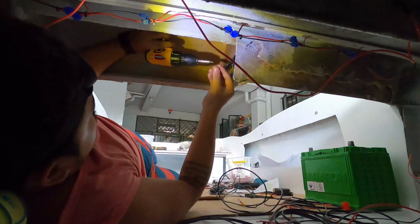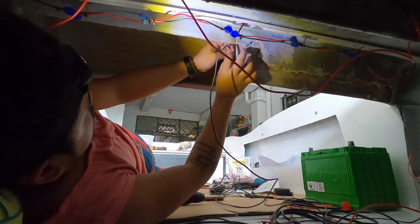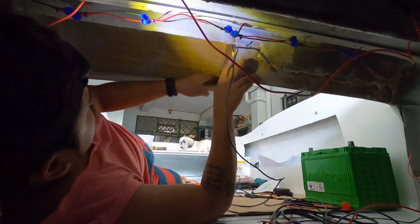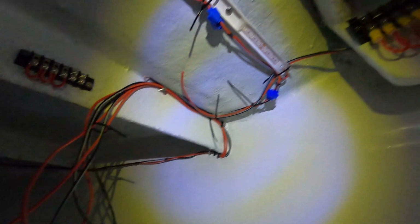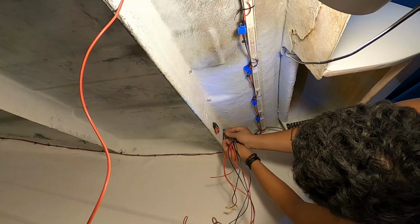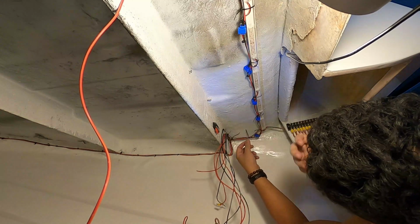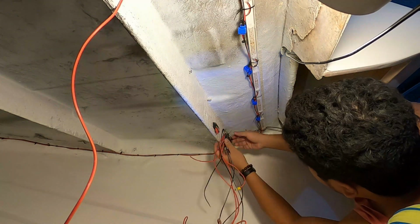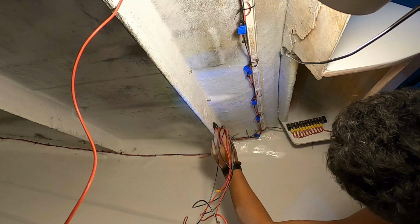In organizing wires, I used screws, lots of cable ties, and a huge amount of patience and planning. It is much better to organize all wires and make sure to fix it properly without having any chance of short circuits. A bad wiring would cause some fires and it would be very dangerous if you are out on the water. Here took me about a week, morning till afternoon, to finish all of this wire organizing.